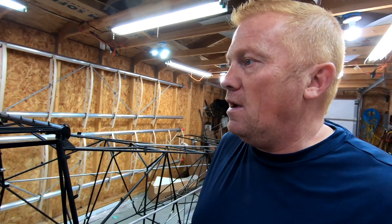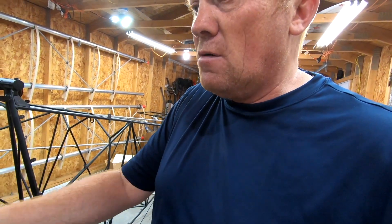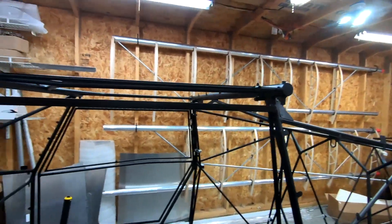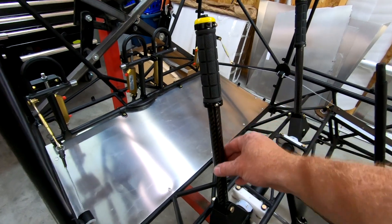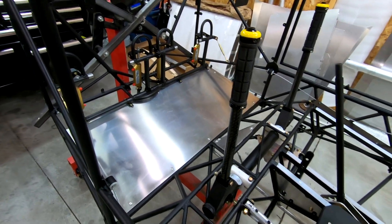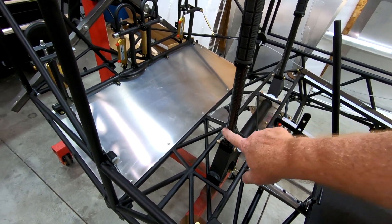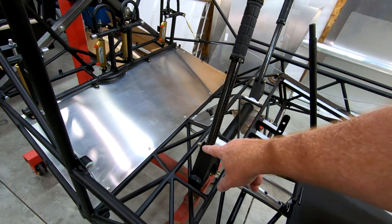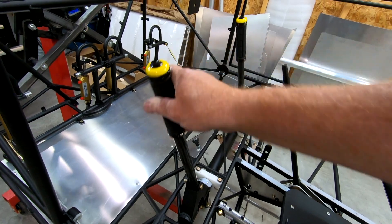There's not a lot of material to work with, so go slow on that or you'll make mistakes. To summarize: seats are in, rails are in, parking brake is in, brakes and turnbuckles are in, cables are all in, and pulleys are all in nice and loose. One last thing — I'm tinkering with the idea of doing a carbon post right here for my stick. This is steel down here, powder coated and clear coated, and I've clear coated the inside too, so I don't think I'll have corrosion issues — it's carbon on steel, not carbon on aluminum. They're lighter, stronger, stiffer, and they look great.